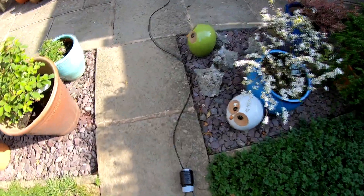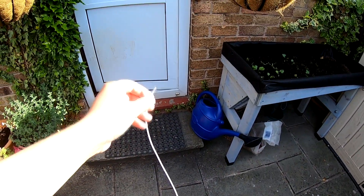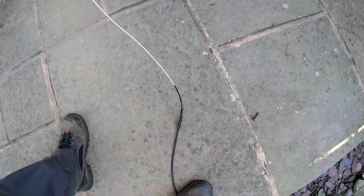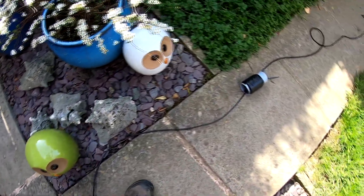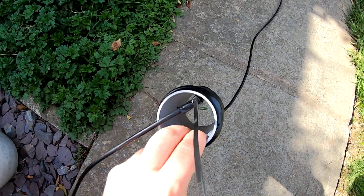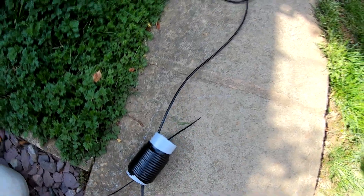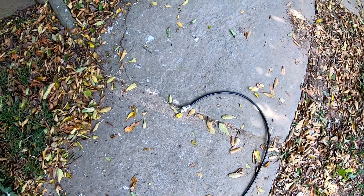It's a fan/stub antenna for six meters. Basically a length of coax, stripped off the outer, and then that carries on partway down. The base is a 50mm downpipe with 13 turns of coax, and straight down to a BNC connector.